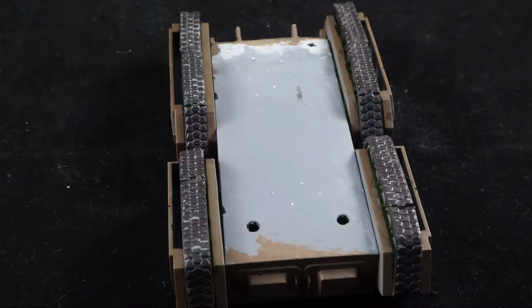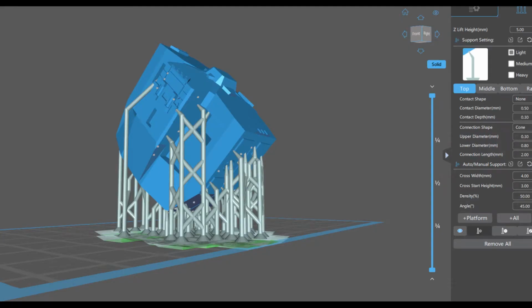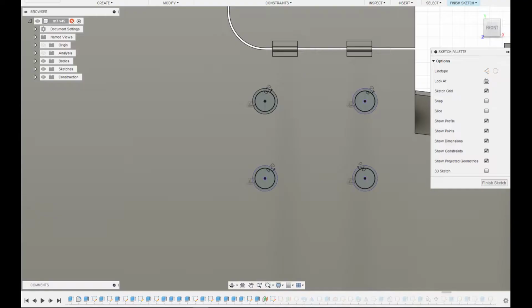Rule 2. One face of your model should be hidden once assembled and be as featureless as possible. This is because the underside of your model is where you will have your supports. Any protrusions will have to have additional supports, adding to the amount of cleanup. Rule 3. Clearances should be 0.2mm for all parts. Your printer might vary depending on circumstances, but this is the general consensus of the community.